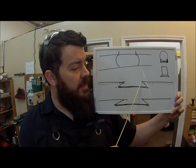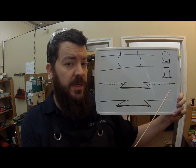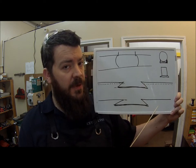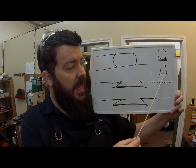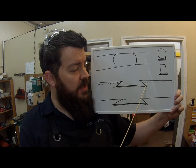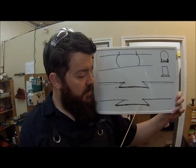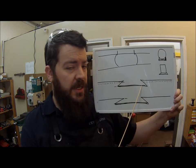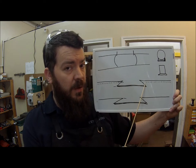The next thing we need to do is measure the depth of the dovetail. The reason I've drawn it twice is because some barrels have a radius cut into them for the magazine tube so that a larger magazine tube can fit up against the barrel. The one we took off the gun does, but the one we're putting on does not because it's tapered enough that the magazine tube will fit without being recessed. We need to make sure the bottom of the magazine tube hanger is flush or maybe a little proud of the barrel surface. If you have a flat barrel like the octagon we're working with, you measure from here to here. If you have a radius cut in your barrel and measured from that deeper point, you'd be cutting too deep and the hanger would sit below flush.